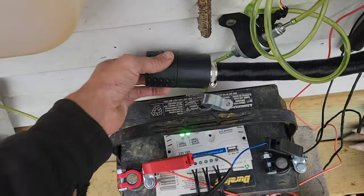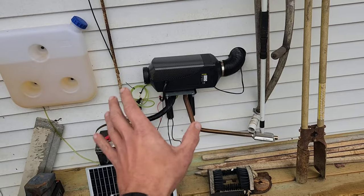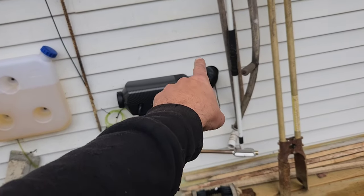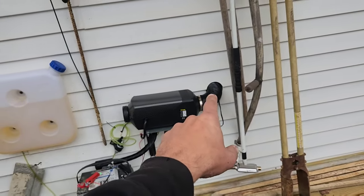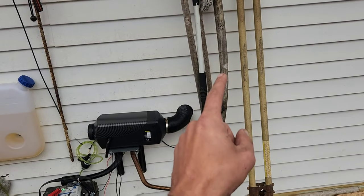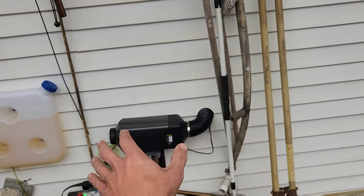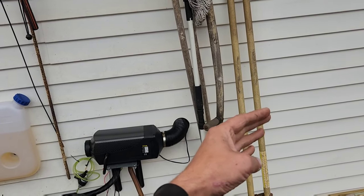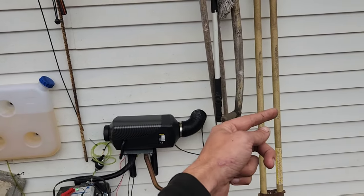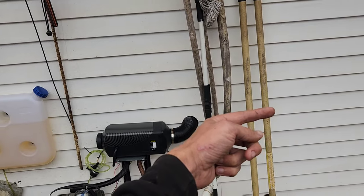This silencer that comes in the system — you do need it. If you do not have that silencer on this system, it is massively, massively noisy. Currently, that is just drilled straight through my 6-inch thick wall going through the insulation straight into the bedroom. One thing we did have to add is, in the bedroom, a dryer outlet with a baffle in it so that this thing does not actually draft through when it's off. We did notice that when this is off, it is a straight-through on the system — there is no baffle built in — and it literally was drafting into the back corner of the bedroom.